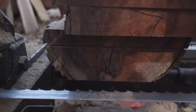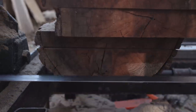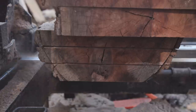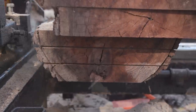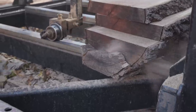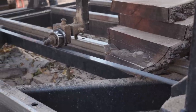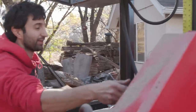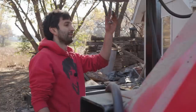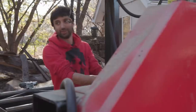It's 220 single phase into this thing, and it'll be three phase out. Yep. And it'll brake the motor and slow start it too. Yep. Which is nice. Otherwise, this thing would take a long time to stop spinning. Like a long time, minutes.